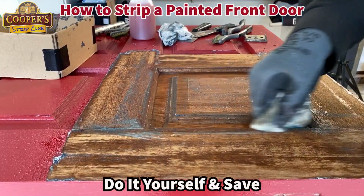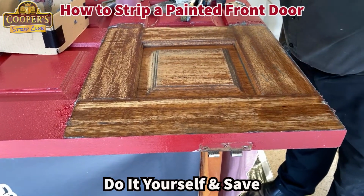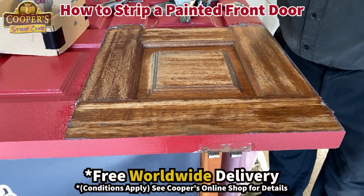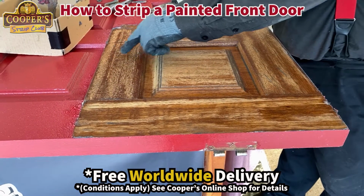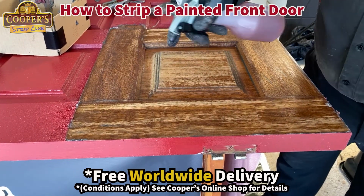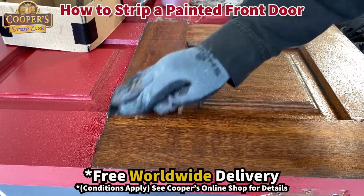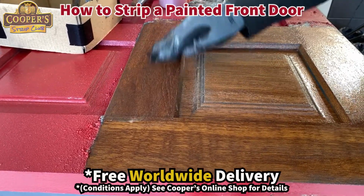The person that made this door sanded it. What I'm going to do now is put one more coat of stripper on. This is now going to get into the grain and get rid of all this varnishy stained stuff. You can just cruise through this door in a day.